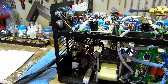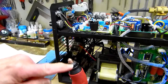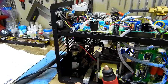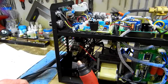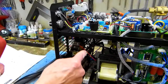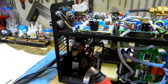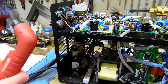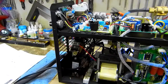On that torch handle — if you take all this apart and jumper across those two pins with your voltmeter and nothing connected, I was actually measuring about 269 volts open circuit. With the machine running and the pilot arc burning, I was getting 125 volts DC across the actual leads feeding the handle. When the machine actually cuts and you get plasma going, I think the output drops to maybe around 90 volts or so.